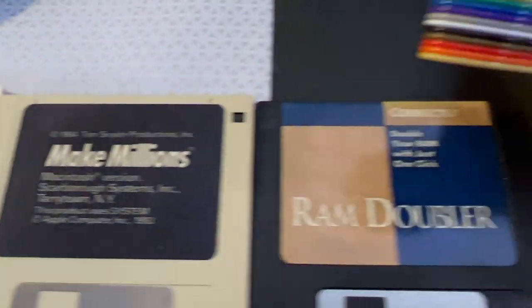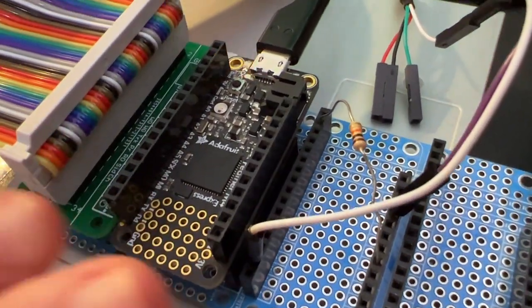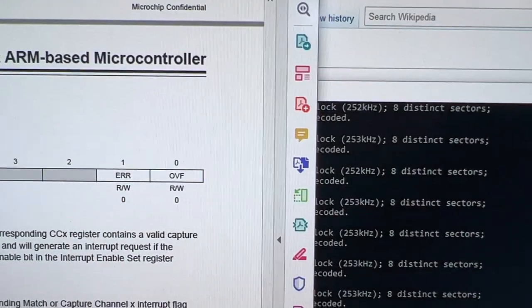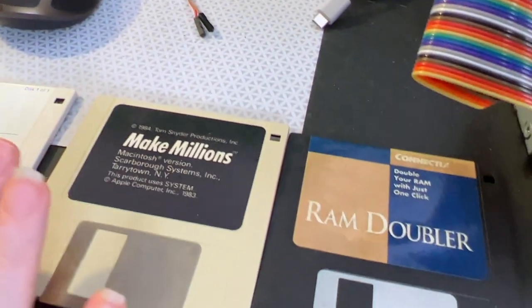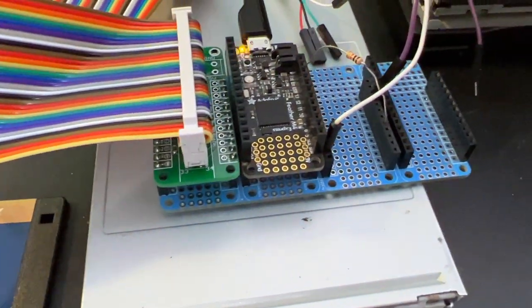Working a little bit on changing the timing of how we read flux pulses, I actually replaced everything with a capture peripheral. Phil B helped a lot with that. So doing capture peripheral and PWM waveform generation for flux pulses, we can get better precision and also better handle long pulses.